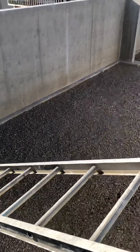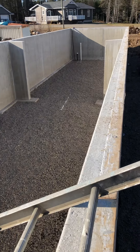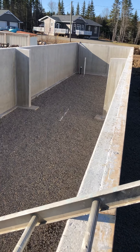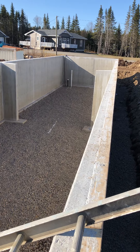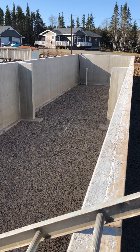I'm going to take a little peek inside the basement. As you look down below, the gravel is also there — any water that happens to come in, we want it to be able to get out. You'll see a white pipe just kind of through the surface of the ground — that's for radon gas. That's a naturally occurring product in the ground that is starting to become a popular topic. We don't see it a whole lot around here, but we do prepare for it.